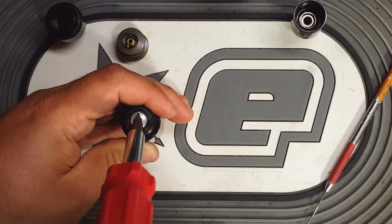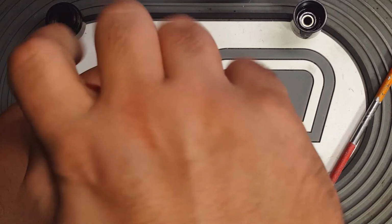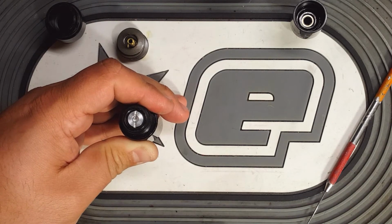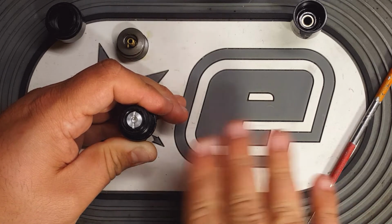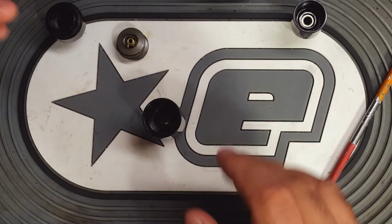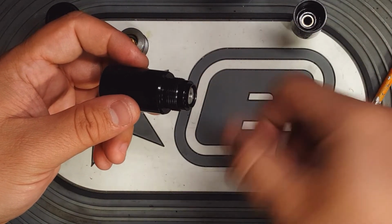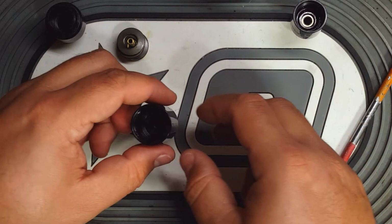So from holding this point at the 12 o'clock position, spin it around one full rotation, roughly one full rotation, and that should be right about 300 psi. It usually gets between 290 and 310, somewhere in that range, which is what Cockers are run best at, or at least that's a good starting point. And then to adjust it, all you have to do is remove the bottom cap and spin in or out. It's very, very small, minute turns to change the pressure.